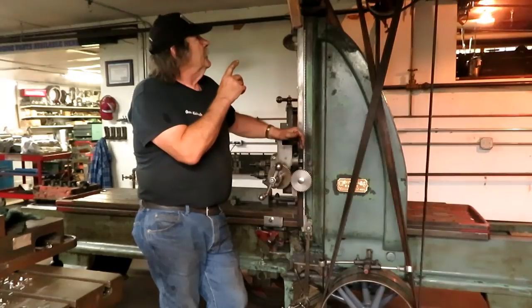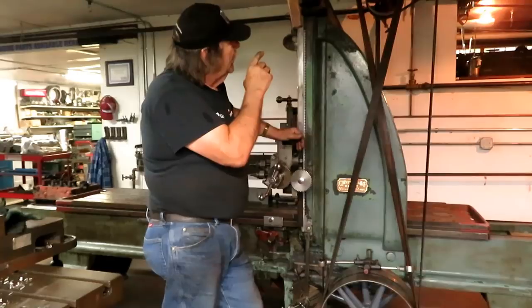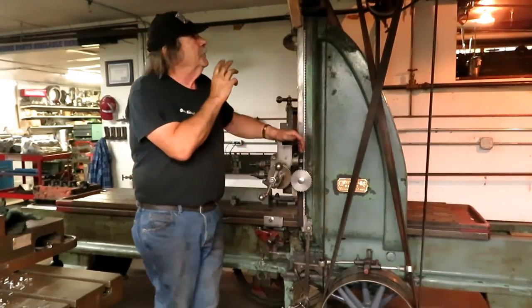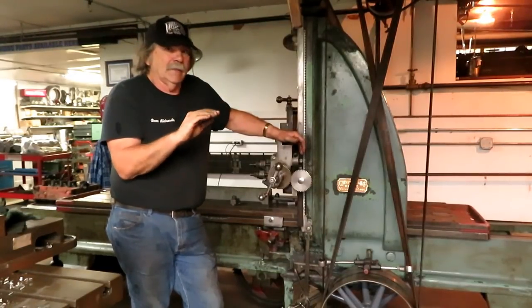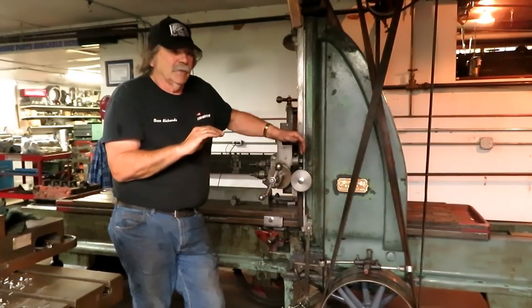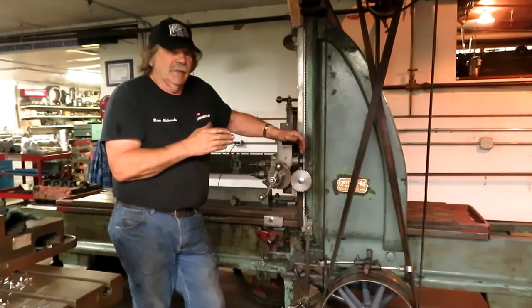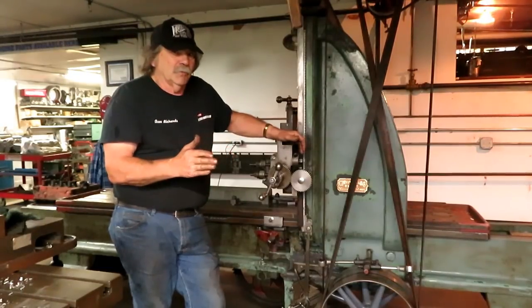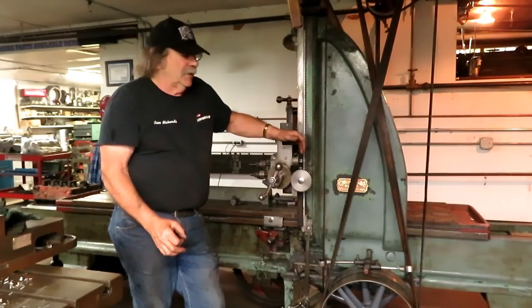The counter shaft, I had to adjust it and change the belt around and change the shifter around a couple of times. One mistake I made was when I put that 18-inch pulley up there, before I put it up there, I should have machined it flat, taking the crown out of it, and I still may have to do that, because that's the driving pulley for a tight-loose arrangement that has to be shifted, and the belt doesn't want to go over the top of that crown as well as it would if it was just flat. So that's one thing I might have to change.